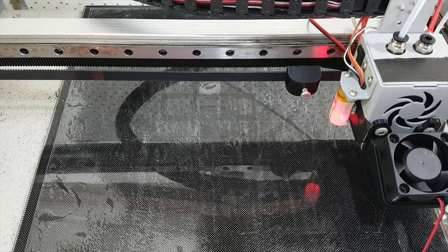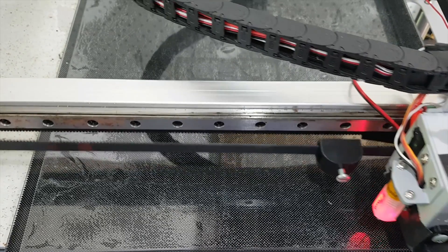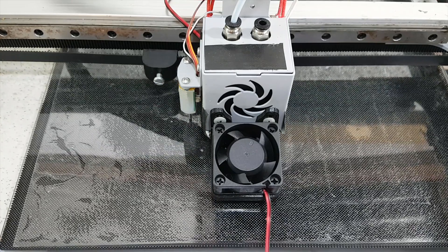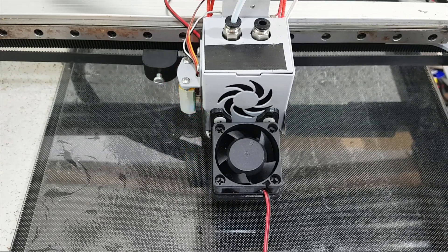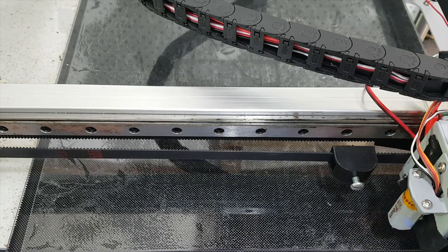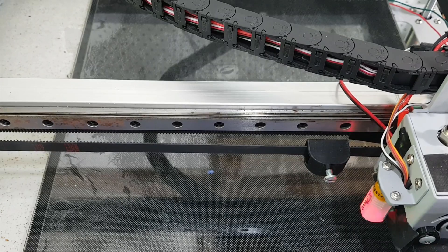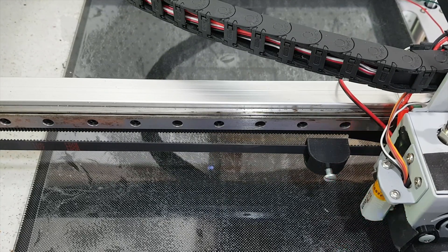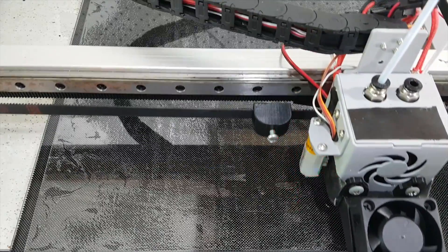So right now I'll try to do a bed leveling with a whole heap of points and see if we can get it to stuff up. There you go — it's now just got stuck. So now it just picks up all the levels where it roughly is and starts printing an inch off the table. This is the fifth time I've run through the auto leveling process and it has stuffed up twice out of the five. The first time I actually wasn't recording.